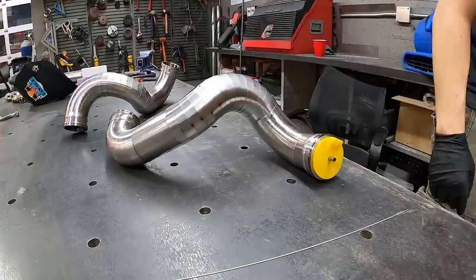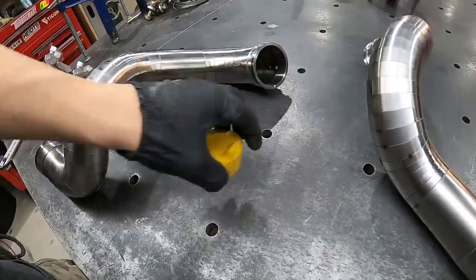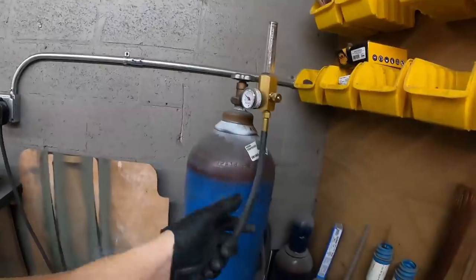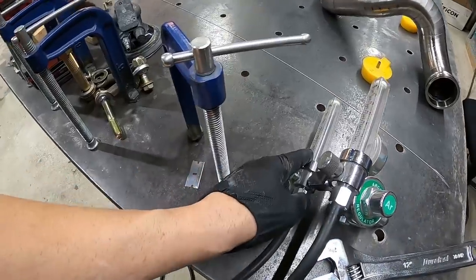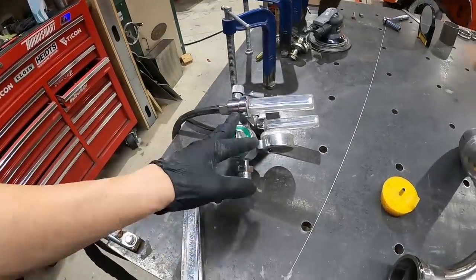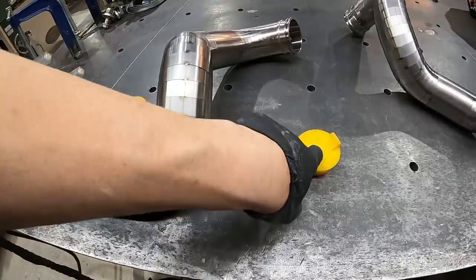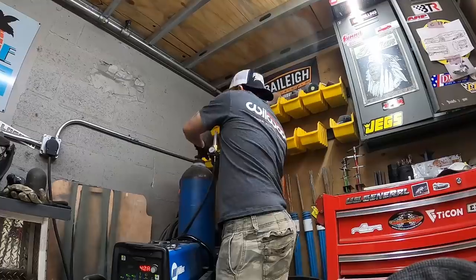Now that our charge pipes are done we're going to start welding with titanium. You have to purge weld because the inside of the weld will get contaminated and turn into a weird flaky discoloration. I use the TIG Aesthetics caps — I have a non-purge setup right now, just a regulator with a single line, so you want to get a double-line setup: set your flow rate for your TIG torch and then set your flow rate for your purge — I usually do about five. One end is completely open so it vents to atmosphere; you want the argon flowing through the pipe, not capped off, because it'll build pressure and the weld will start backing out on you.